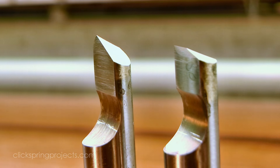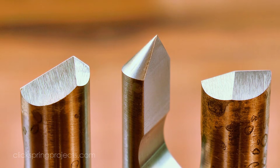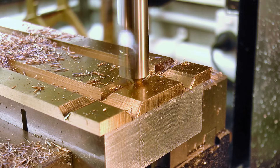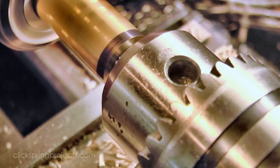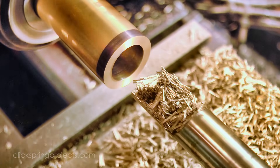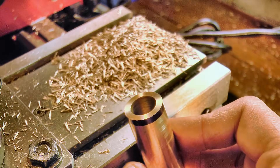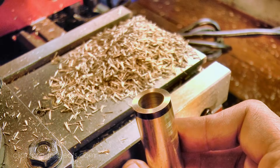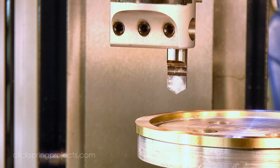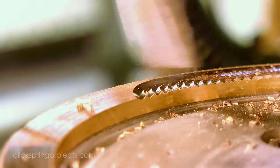For other shapes, putting in the relief angles can be quite straightforward — it really depends on how the cutting edge will be made to move through the metal. D-bits are an incredibly versatile and effective type of cutter, and there are many ways to use them beyond what I've shown in this video. They're particularly well suited to drilling very deep close-tolerance holes, and can be tailored to suit a specific requirement — for example, a square bottom to the hole. They're a great way to solve those unusual cutting problems that crop up from time to time that might otherwise require spending money on an expensive cutter.